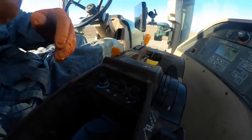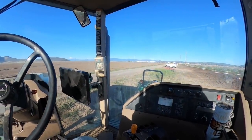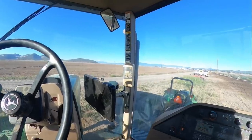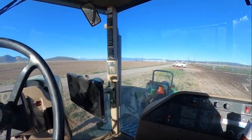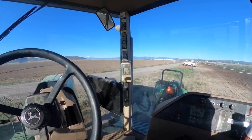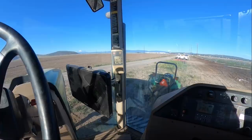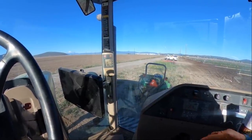I just got to get the oil. It's 39 degrees Celsius. It actually went into calibration mode, but it's just not quite right. I gotta get the oil to warm up here. I went back in here after I got the oil warmed up, went back in to do it again, and then it told me error 48 and said that I needed to do the procedure 1 again, which is the steering angle sensors. So there must be a fault in there. So let's see if we can get it to cal.